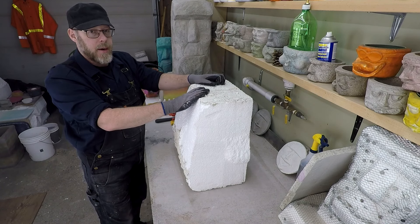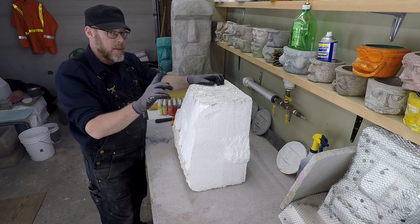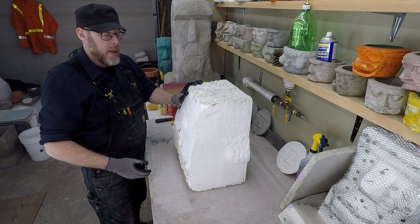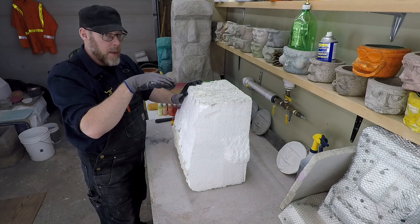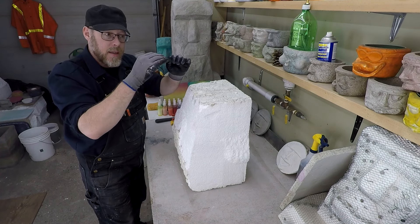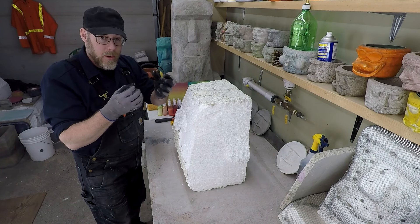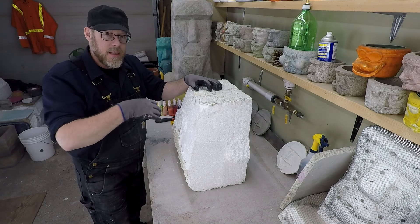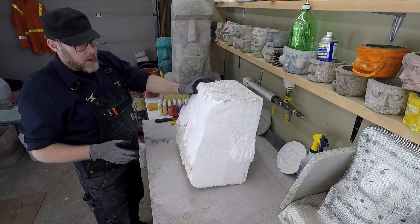The finish layer is a concrete sealer, and it's important you know that. Just like with any concrete application, you should regularly upkeep the sealer to minimize water permeation. The water permeates into the surface, and as it freezes that water expands, takes up more space, and that surface layer spalls - you get little concrete explosions and divots on the surface. We definitely don't want that.